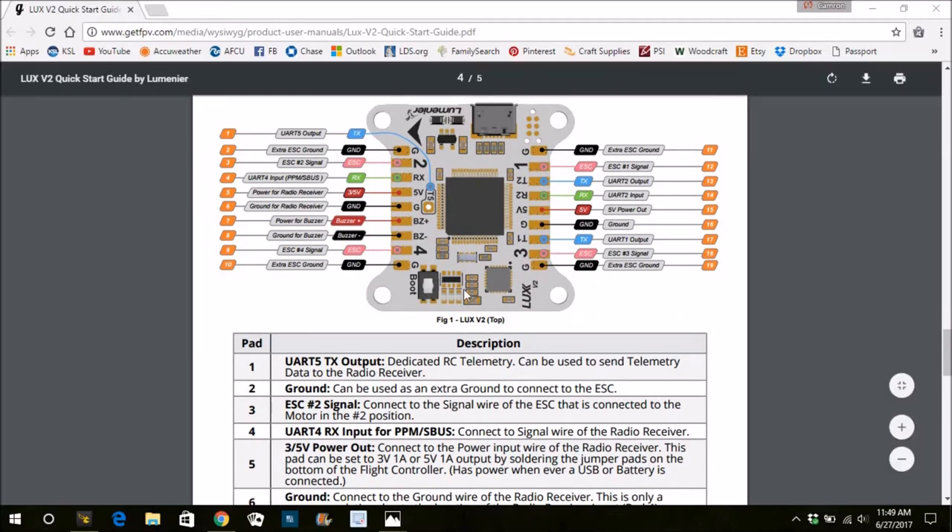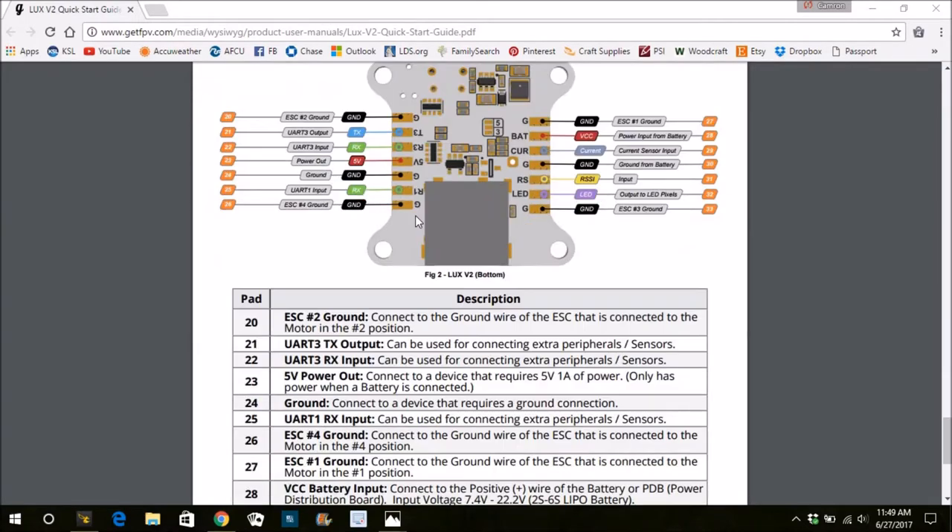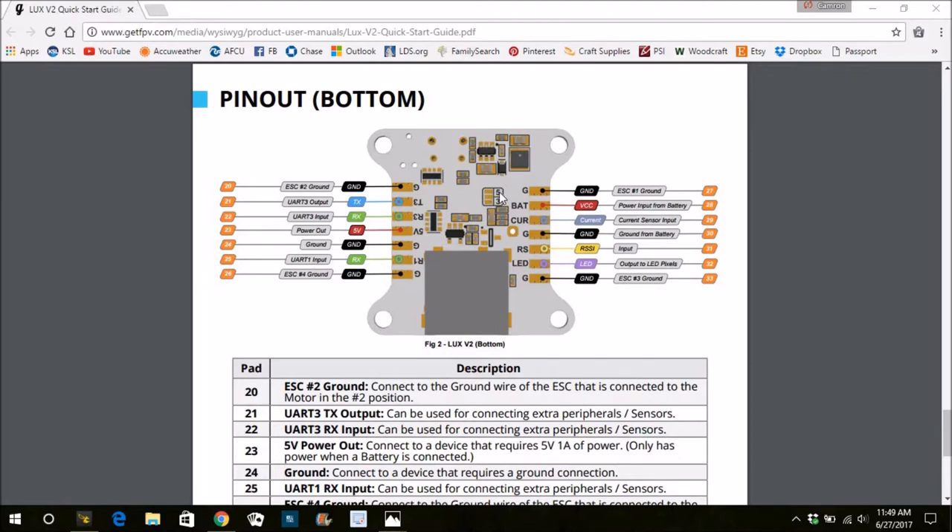Right here is the top of the board — you can see the front of the quad with the arrow. This three-slash-five volt pad is where you hook power to your receiver, RX is where the signal from your receiver comes in, and ground is right here. These three are the ones you need to hook up. On the bottom of the board there are three pads labeled five and three — the center pad soldered to the top gives you five volts, and soldered to the bottom gives you three volts to the receiver.